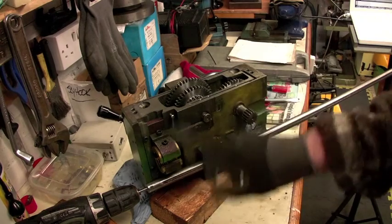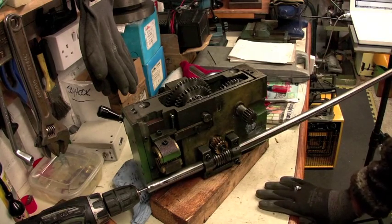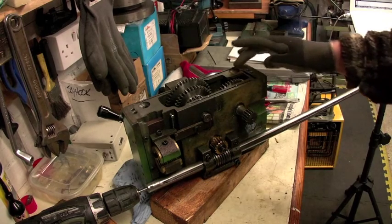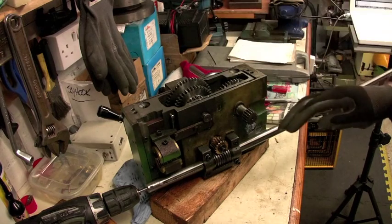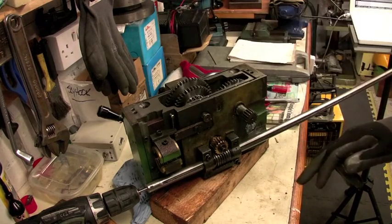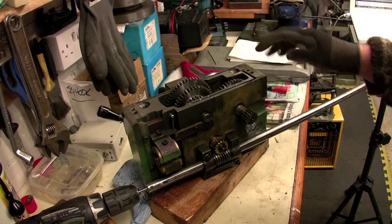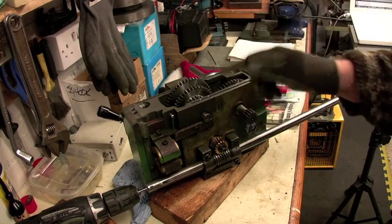This is the back end of the apron, something that I think most of you will never have to look at. But if you want to make sure that all the oil is getting into the moving parts, you will have to take this off to check - to make sure that your lathe is not as completely useless at getting oil into the moving parts as the BH600 is.